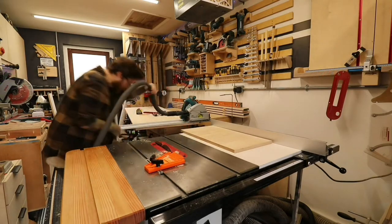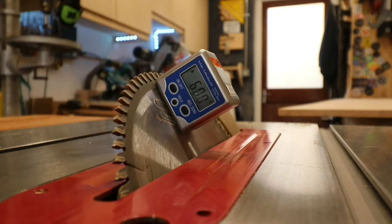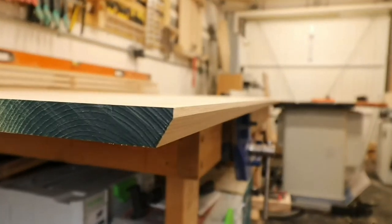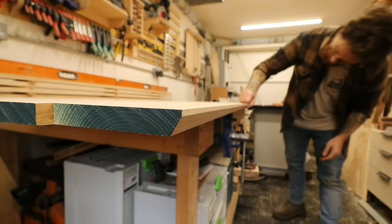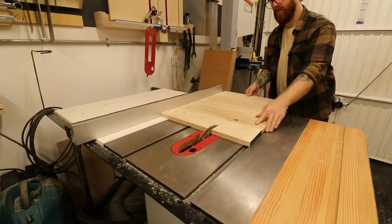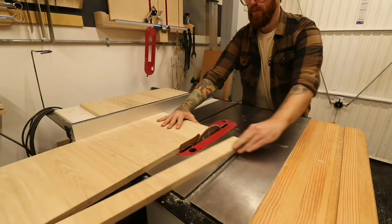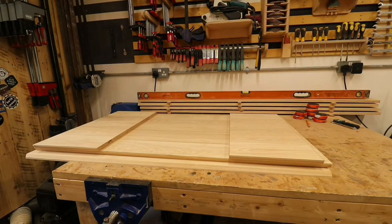At the beginning of the video you may have noticed a beautiful little chamfer detail — it adds a little je ne sais quoi. I do this on the table saw, but you can do it with a track saw or a router if you have the right bit. Now I'm cutting the top, bottom, and two sides into their square sections, but without the mitres just yet. I personally prefer to get them into square sections first and then do the mitres afterwards — I just find it way easier.